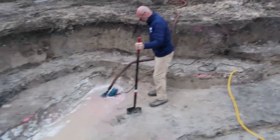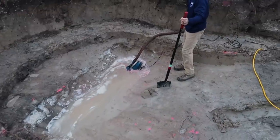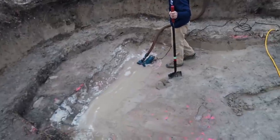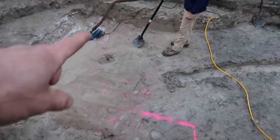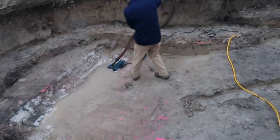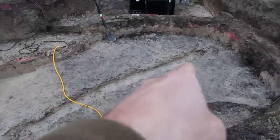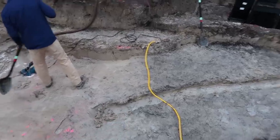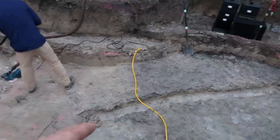We are at the beginning of day two. We had a little bit of water filling up this area down here at the deep spot, so all we're doing is draining that out and then we're going to over-dig this area so that we can have plenty of room to build our brick wall based on the depth of the pond. You can see this trench has already been started - that is going to be where the perforated drain tile is going to sit.